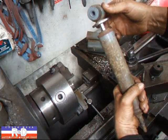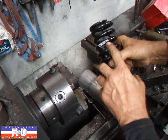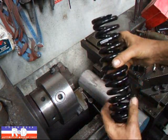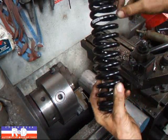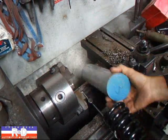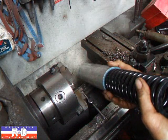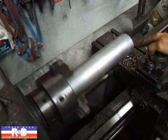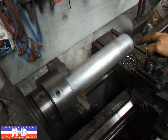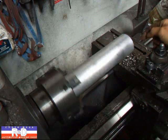These springs you can buy on eBay or other places. This one happens to be a 350 pound spring, which means that for every inch it's going to take 350 pounds to compress it. I've got some aluminum here but it's a little bit big and that's okay because I can cut it down. As you can see this thing has got a little bit of runout, so we'll go ahead and straighten that out and we're going to center drill the end so we can support it.